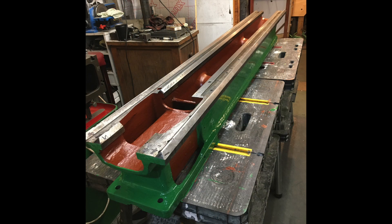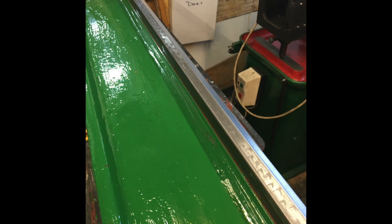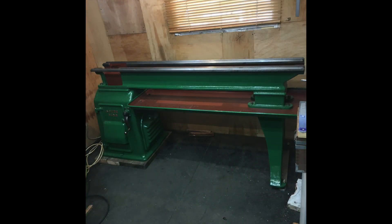These two jacks provide the ability to level the main bed and remove the twist from the bedways. I'm going to leave it to settle a few days while keeping an eye on the spirit level. For the moment, the main bed is going to be the last thing assembled onto the pedestals until the bedways have been sorted — and yes, they're going to be dressed in situ. Wish me luck; I think I'm going to need it. Thanks for watching. Bye for now.